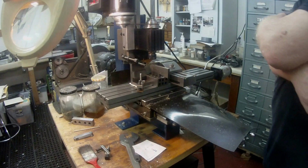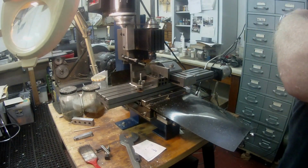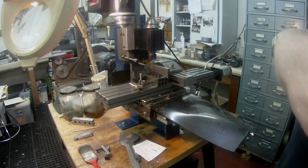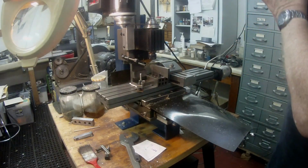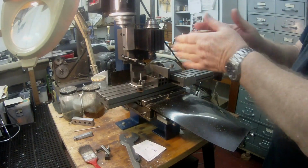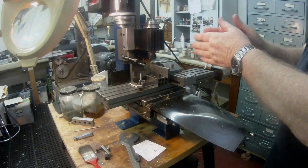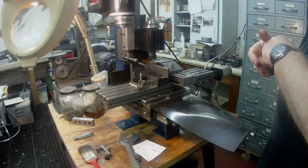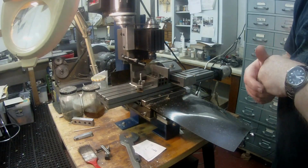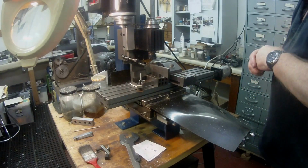It's .156 diameter, and so I'm just spotting with a centre drill the progression of the cams and the rocker shafts and the rockers. I don't know whether this is going to turn out okay or not. I'm kind of disillusioned about all this filming stuff.